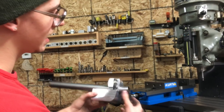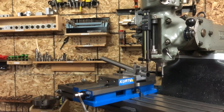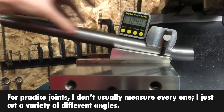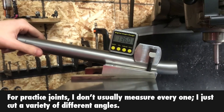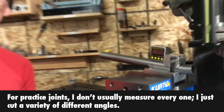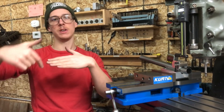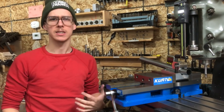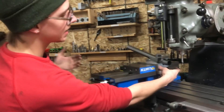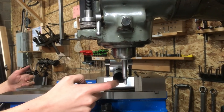Here's a scrap that I have — it's got a little bend at the end. We're just going to put it in the milling machine vise. Now if I want to set it to a specific cut angle, I just use this digital angle gauge — that'd be 13.6 degrees. You can set it to whatever you want. I like to do a variety of angles. A 90-degree joint is going to be the easiest to weld. If I do something more like 60 or 45, that gets harder to get on the inside, so that's good to practice too. Now I need to get on the tubing centerline. I designed this tool to be three inches wide, so I'll touch off my edge finder on this side, then move over an inch and a half, and I know I'll be on the tubing centerline.